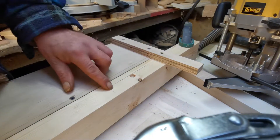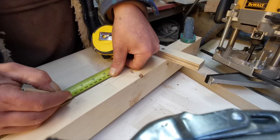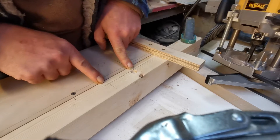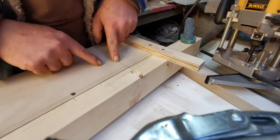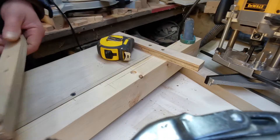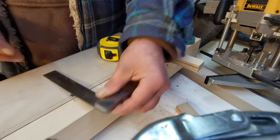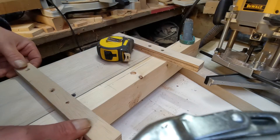I can work out that distance now — where to put this stop. So 179mm. I want a mortise of 75mm and that distance from the edge of there to the edge of there when I made that cut was 53mm, so come back 53mm. Put that on there.